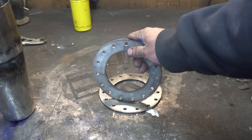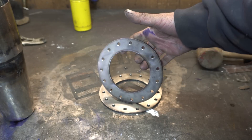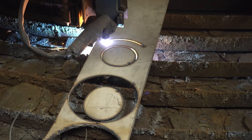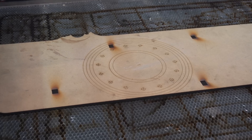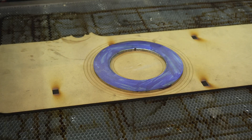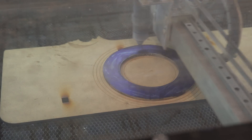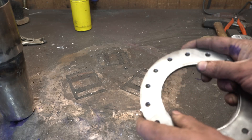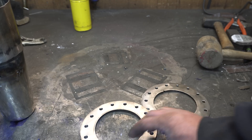Got the goods. This took me a while to get right. There are 15 holes on these things and they all need to line up just perfect. So what I ended up doing is I cut the shape out on the plasma cutter and then went over to the laser, etched a piece of wood with some circles so I could line it up, covered this thing in Dykem, and then etched the center spots on with a laser and then drilled them out by hand. That's far more work than if I just center-spotted it on the plasma cutter, but those holes line up nice. So let's get this thing installed on the pump.